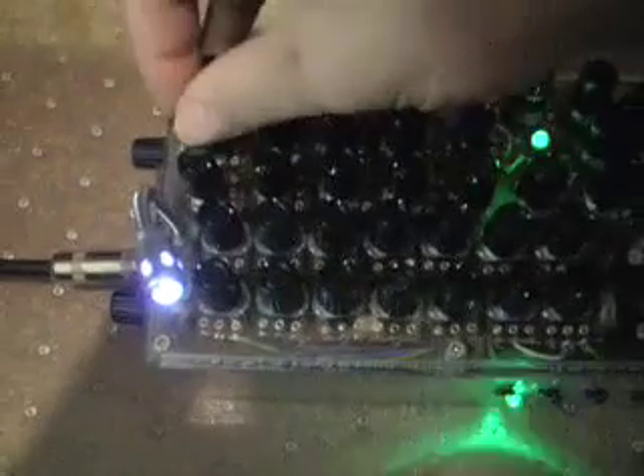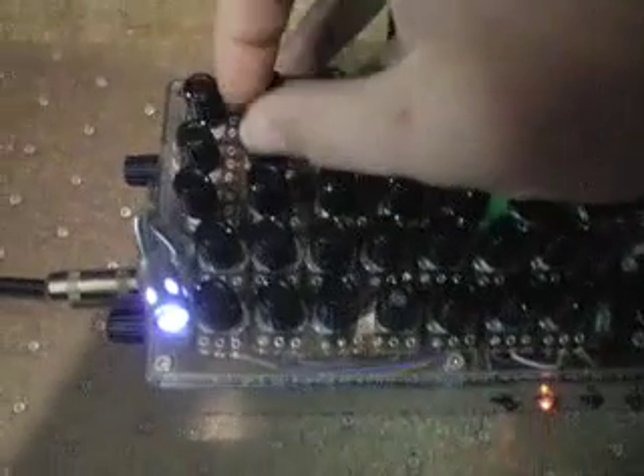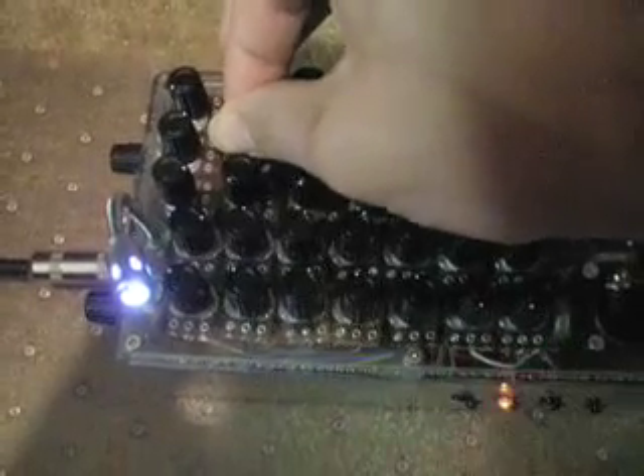That's then sent into the voltage-controlled amplifier, whose knobs are right here. The VCA has five controls. One is gain — you can hear the amplifier start to clip as I turn that. The next one is what I call the miss-bias knob. You can kind of think of it as twisting the amplifier's arm — it really doesn't like it. It's kind of like a circuit bend, and you can hear that eventually it cuts out.